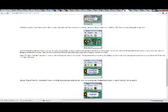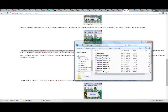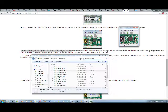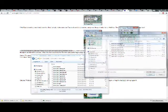So from the File menu, choose Open HEX File to open blinkfast.hex, which is one of these things you downloaded. If you wanted to download it, you can download it. You don't necessarily have to. Blinkfast.hex is in here somewhere. So probably blinkfast hex. Well, blinkfast teensy 2 hex. Nope. This file, open hex file. I'm gonna copy this, and then I'm gonna do blinkfast teensy 2 hex.